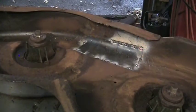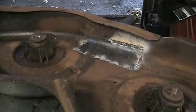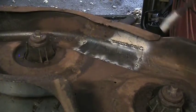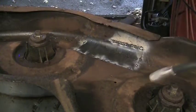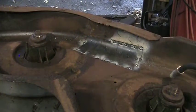There's some porosity in there because of the rust, but it's going across. I'm going to continue doing that — down the other side, all the way around. I'm just doing little tacks: spot, spot, spot. Flux core is not ideal for that, but that's what I'm going to do. Come back when it's all beaded in there.